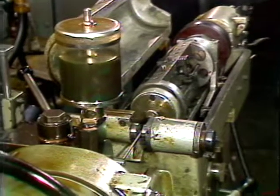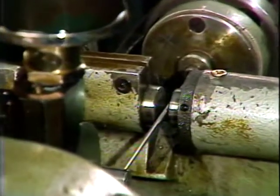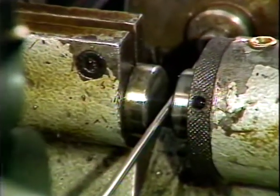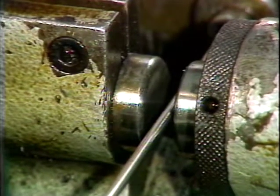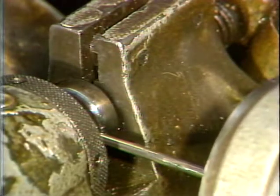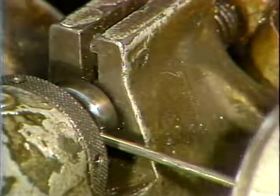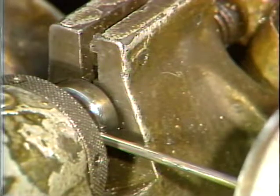These are the stock clamping jaws, located at the front of the stock straightener. The purpose of the stock clamping jaws is to grip the stock just before the backward stroke of the straightener slide. This will prevent the stock from being pulled backwards, which would cause part length variations. The stock clamping jaws release the stock before the forward stroke of the straightener slide.